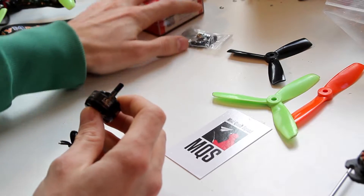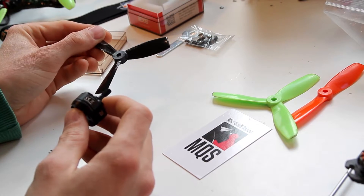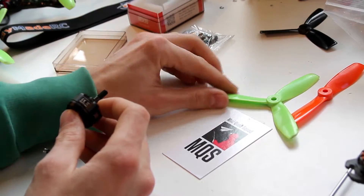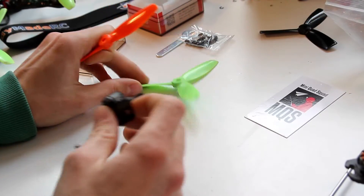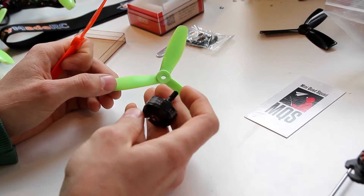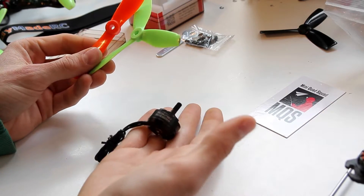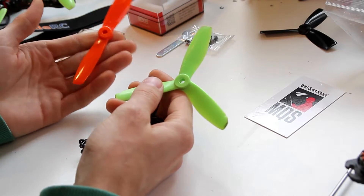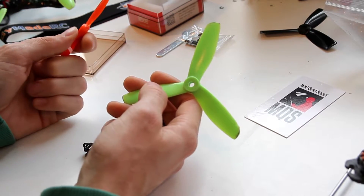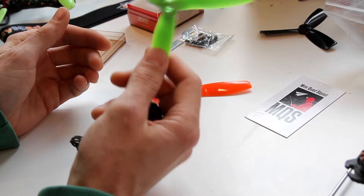We've been testing these motors now with different props. We've been using 4-inch props — Ryan's been testing that and he's been loving the power he gets out of them. I've been testing them on 5-inch. I was initially expecting them to overheat, because usually that's what happens with high-KV motors — they tend to be very inefficient. But these are surprisingly efficient. I was using 2-blade props first, not really seeing any cutout on flight times compared to 2300KV motors, and then lately I've been using them on tri-blades and they really scream with those.